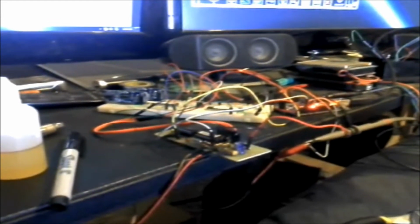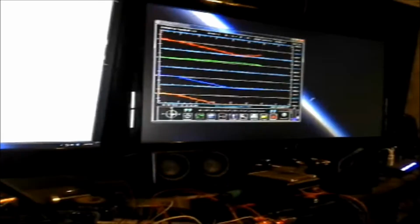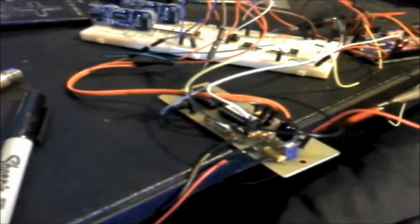Many orders more precise than the Honeywell digital sensors that are in our lower resolution magnetometers. So you get this as a kit, and this small circuit board right here does several things. It's got power regulation. There is an ASIC, an application-specific integrated circuit developed by Speak specifically for the sensor.